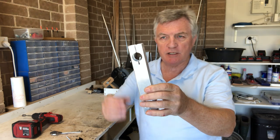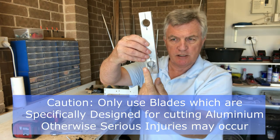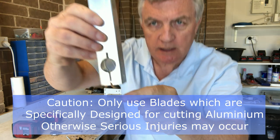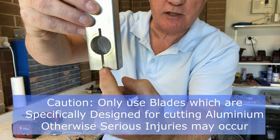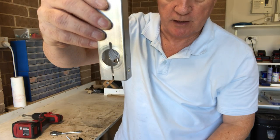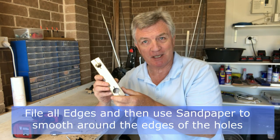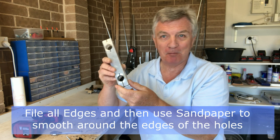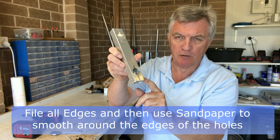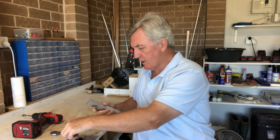The final couple of operations: I'm going to take my workpiece over to the table saw, put it on like that, and just literally take the table saw blade through it. What that does is give me a slot through here which is about three millimetres, and I've also taken it slightly up here as well because we're going to be squeezing this together this time — that seemed like a good idea to me, may not be necessary but I liked it so that's what I've done. I've also drilled a six millimetre hole all the way through the piece here.